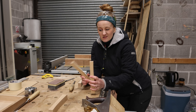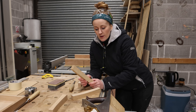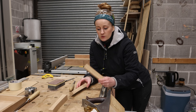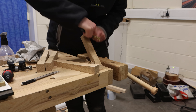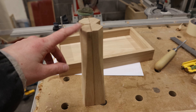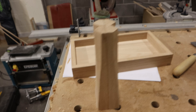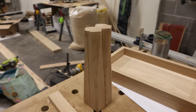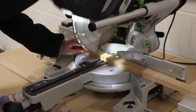I've taped up the box, cleared as much squeeze out as I can, and just rested the ends within the box so it takes a shape. Hopefully that'll help minimise the fitting we have to do once it's dry. Now that both trays are drying, I'm going to go back and work on the stand. We previously cut out the vertical legs on the bandsaw, so I'll take one now, get it to final shape, and then we can use that as a guide for the rest of them. I'm also going to be taking a spokeshave to these to shape them.